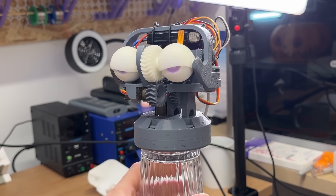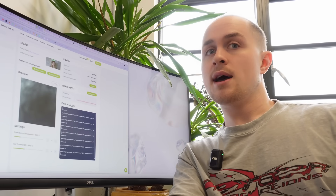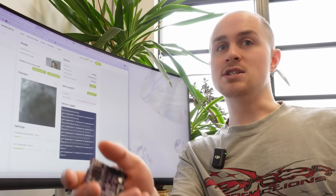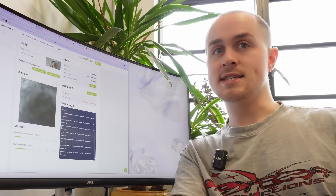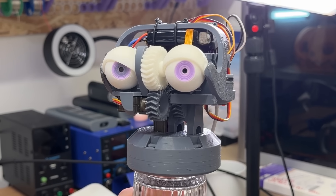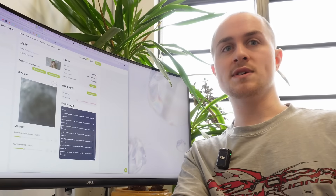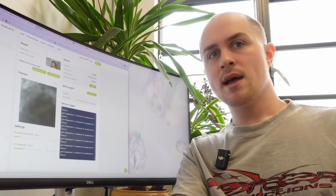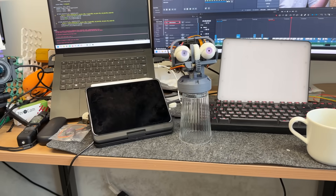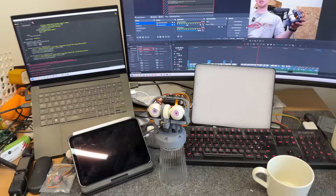That's because my servos are driven with a management system that tracks their current position, velocity, and acceleration. With the main loop being slowed down so much by having to read the vision board, it's not able to adjust the velocity of each servo fast enough, so it frequently overshoots its target and goes back and forth. By fiddling around with the code I eventually got this running at a workable pace. I don't think I have time to perfect this before Halloween by myself, but I'm really interested to see what the community can do with my open source files in the comments and on my Discord server.